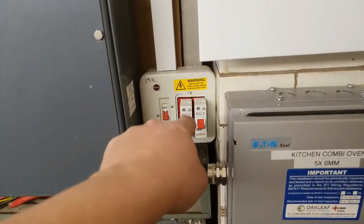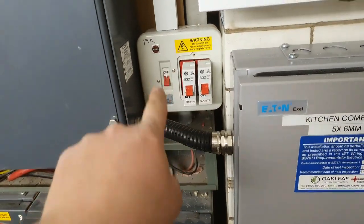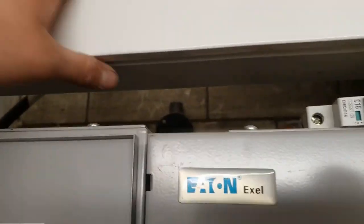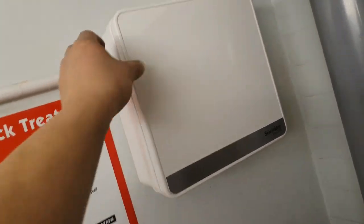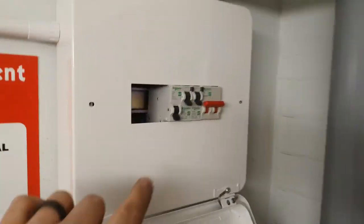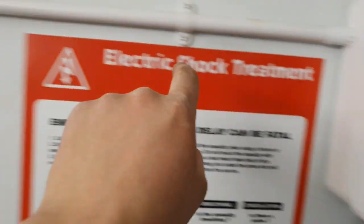Right, I've joined all the cables in there. They go up in the trunking. We are going over here into the mismatched trunking and lid, which I think was done when it was refurbed, so we're going to sort that out. New board, I haven't put the screws in yet, or the blank plates. I need to get a 10 or 16 amp circuit breaker because I've incorporated the water heater into this.